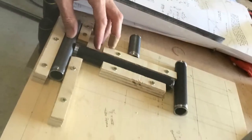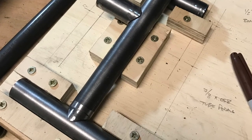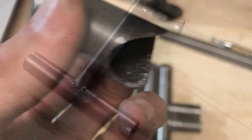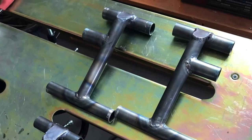In this video we'll talk about my process on the rudder pedals. I don't have live video of any of that, so it's just based on pictures from my builder's log, but hopefully it gives you the idea of what I did. First, you need some square jigs — draw them up nice and square on a piece of plywood and put in all your locator blocks so you can have everything built to the exact same dimension. Since you're building four pedals, you need all the help you can get keeping them consistent and square. I initially started notching the tubes with a hole saw on my drill press, but you can also find a tubing notcher at several different places. I ended up doing the rest of my project notching with an angle grinder.